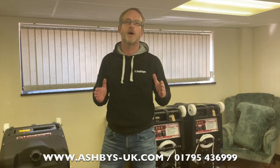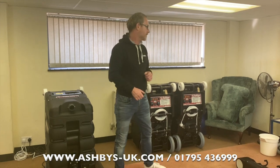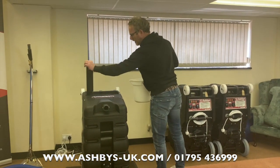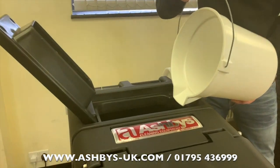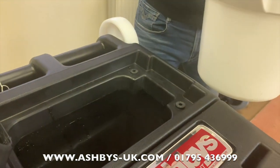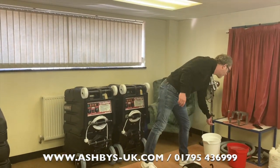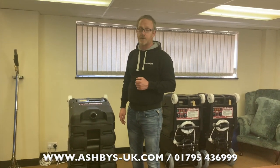When you fill your machine, always use a nice clean bucket, because any metal-headed pump — whether it's 400, 600, or 800 — doesn't tolerate grit. Our advice is to use a liquid rather than a powder, and to fill with a very clean bucket. We have our buckets colour-coded: red for dirty, white for clean. The machine has a funnel design so the bucket lip fits in perfectly — it's very difficult to spill. Never use a bucket you've used for emptying, as you don't want to introduce grit into a pump system, especially one with a steam mate.